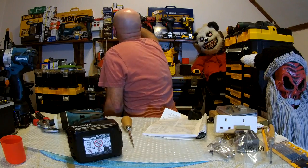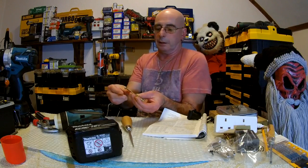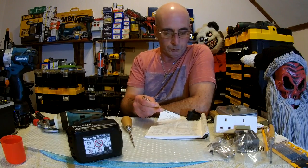The problem with electric clutches, as I've always found, is when you come to self-countersink screws, the ones with all the fancy-dancy things on them, like this here. Now, I'm not saying the electronic clutch has got to be powerful enough to put this 100mm screw in, or 4-inch by 12 gauge, or 6 by 100mm. What I'm getting at is, these you don't have to pilot hole, they just go straight in. So what they're saying here is, you'll have to use conventional screws, pilot hole them, and the E-clutch should work fine. Well, okay, we will try it that way, but maybe if I'd read the DeWalt DCD996 instruction booklet it might say that's what you're supposed to do. But as far as I know, you don't. But I'm prepared to give the E-clutch a good go.